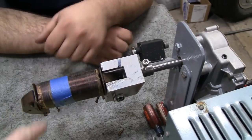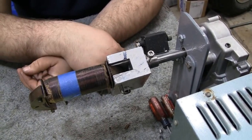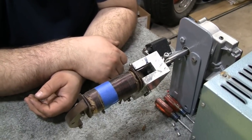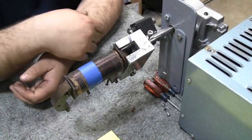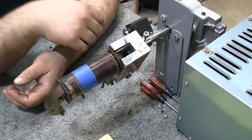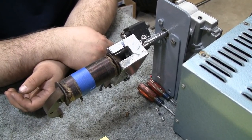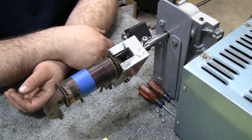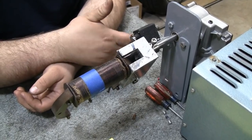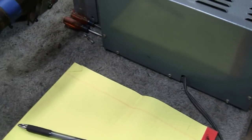What Mike's going to do is cut this down — take the secondary off and make a note of how many layers there are, and see what the primary wire looks like. We pretty much know how many turns it's going to take: in the neighborhood of 10,000 to 12,000 turns total, probably about 22 layers and around 400 turns per layer. If you end up with 9,000 turns instead of 10,000, it's not like you won't have spark — it'll still run a hundred-year-old engine. It's pretty forgiving.